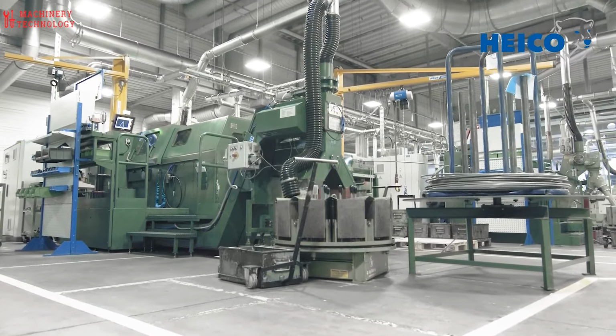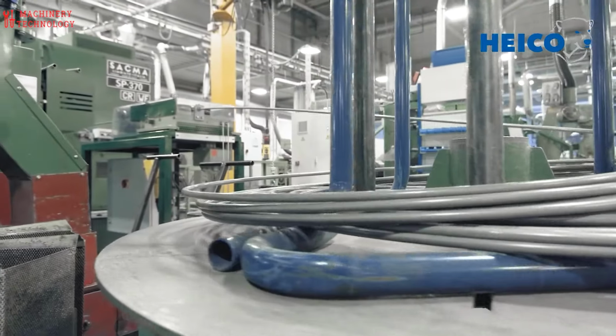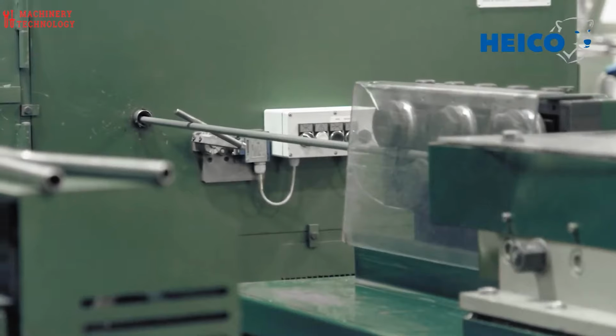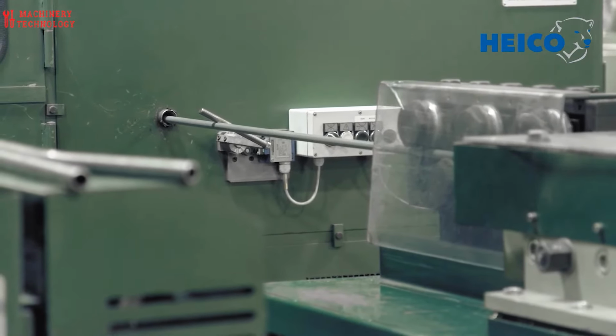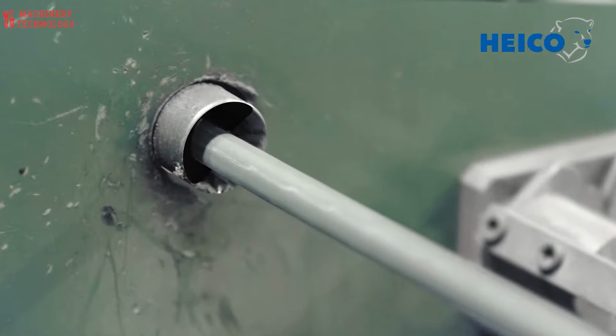You've likely come across the term cold forging before, but what exactly is it and how does it work? Unlike hot forging, which involves heating the metal first, cold forging is a metalworking method that shapes the material at room temperature, or even cooler.